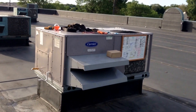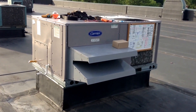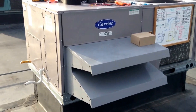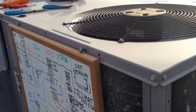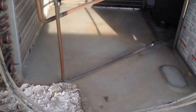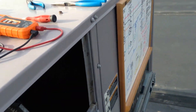I'm going to try to do another quick video on carrier products. Got a carrier here with a similar problem to the Lennox I showed you a few weeks ago, where it's a carrier unit with an economizer. It's a six ton unit with a single compressor in it. I was here and tested out the economizer today. I'm going to start by showing you the hardware and then we'll run through a test out process.